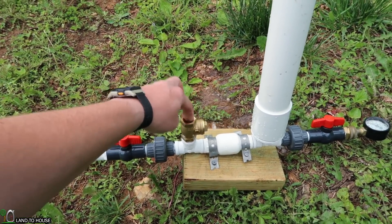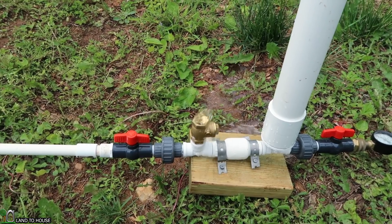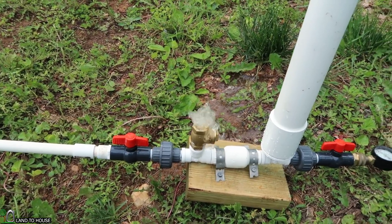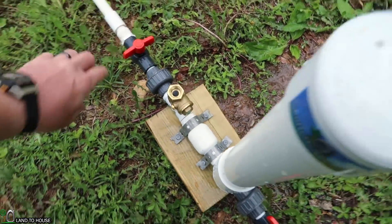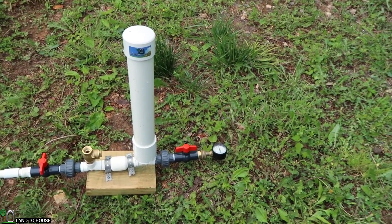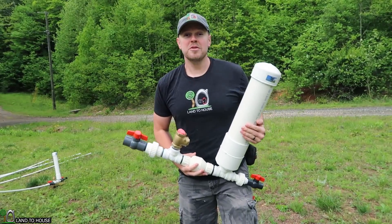I'm having to prime pressure into the pressure tank here, and that's why I continually push this valve down. The timer is going. I can already see a significant increase in the cycle time — it's moving much quicker, but it is working. Time. I'm noticing that we only have 40 PSI down here, which means we are about 8 PSI short. Not only has it cycled faster and produced less PSI, we've also used a bit more water than in the previous test. The quicker cycles have actually used more water.